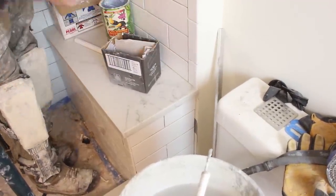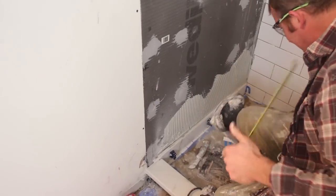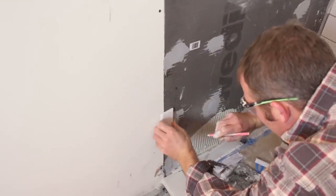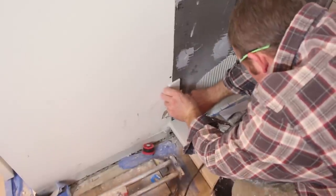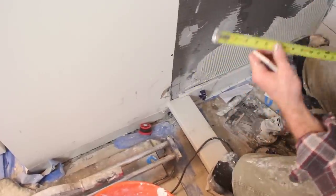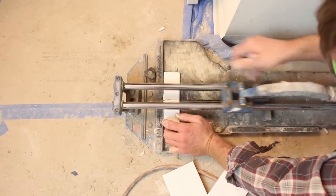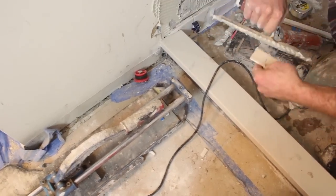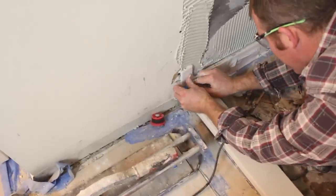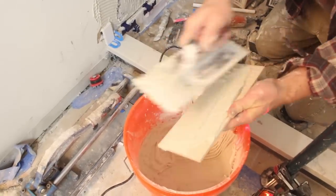So 69 inches to my closest full tile here. I'll be able to take a bullnose piece and determine where I am from here. I'm going to start off with a 3-3/8 inch piece and I will make my bullnose line up there. We're applying our thinset mortar to the wall and to the back of the bullnose — even the bullnose we want 95% to 100% coverage. Those little horseshoe shims definitely come in handy when you're using the subway tile and the bullnose.